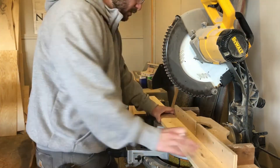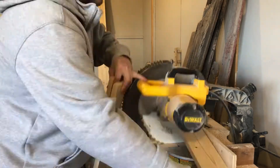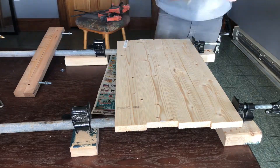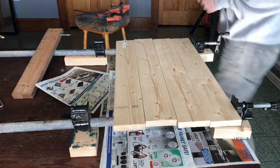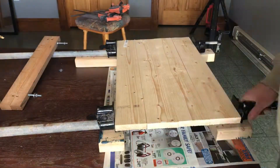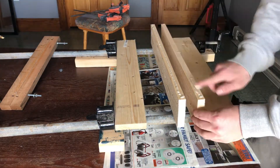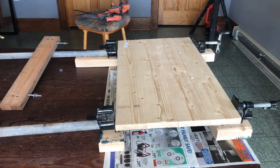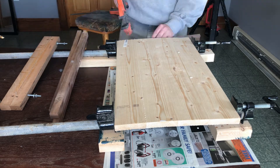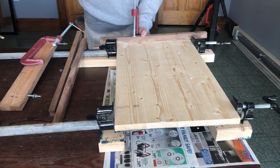The whole project starts right here where I cut four boards at just under 24 inches and then we'll begin the glue-up process to make the backing. This step is basically just your simple panel glue-up — not real intricate, not real hard. I usually just spread glue on one edge, put the other edge down, and squeeze everything together just so that it's snug. Then I start adding my clamping cauls so that I make sure everything stays straight and flat.